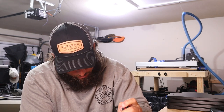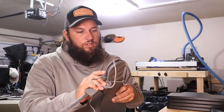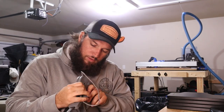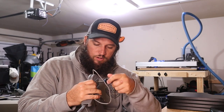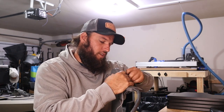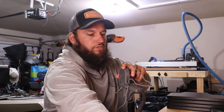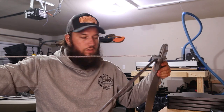We got it in there. Use our pliers just to make sure it's nice and tucked in the hole — just like that. We're in there, good on both sides, no friction problems. Here's the test — slid up nice and easy. This pin originally was on the right-hand side, just gonna push that through. Take our other little machine screw, put that back in place, get it started nice and easy — last thing you want to do is cross-thread this. Both spinning now, give it a nice little tighten — boom, good to go.